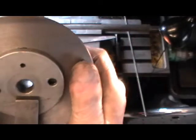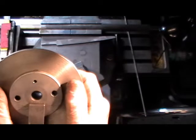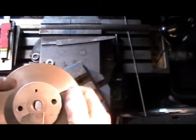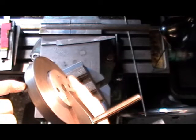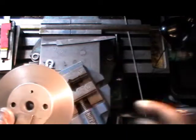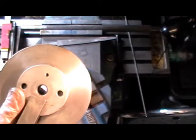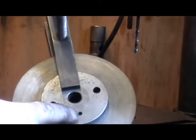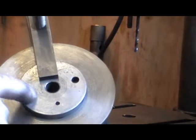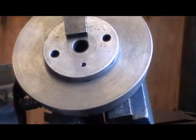I'm not sure if you can see down that hole. I'm half and half now in the cast iron wheel and the crank pin. I'm going to drill down now to the depth, which will be 20mm I think, depending on how thick your wheel is. I'm over at my drill now and I'm going to drill down this guide hole to just before the depth of my wheel.